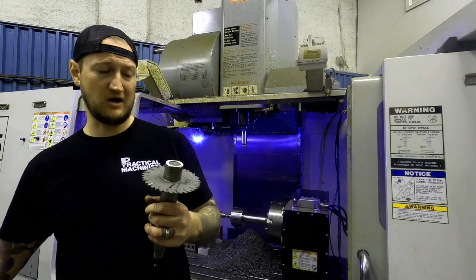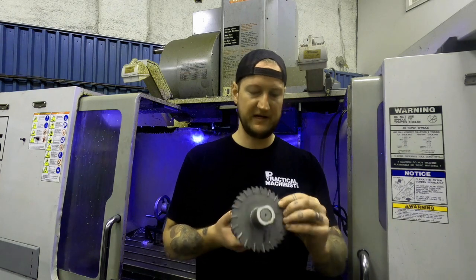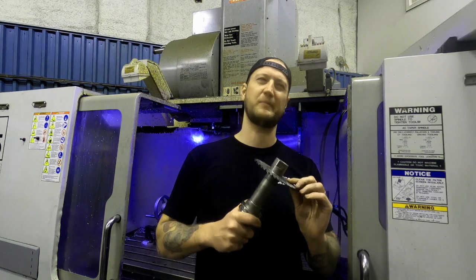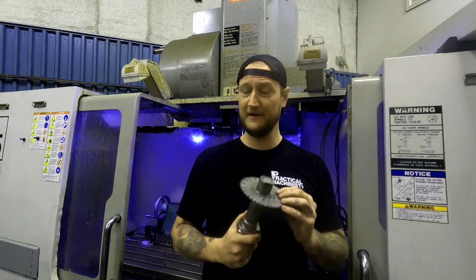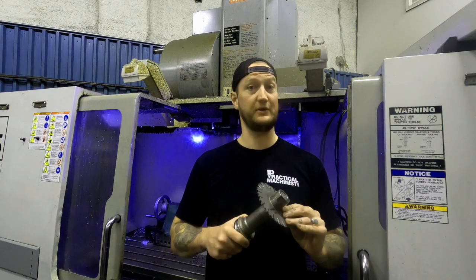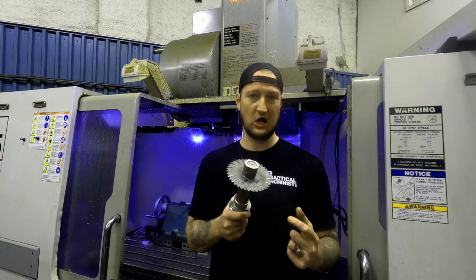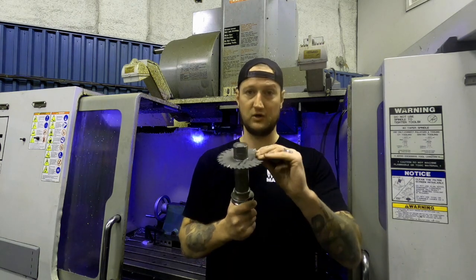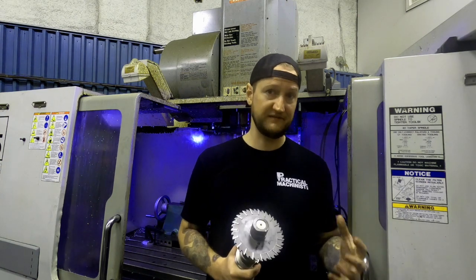Now this is just an off-the-shelf slitting saw. It's carbide tipped, which is nice, but the body is just high-speed steel. We're almost at the point where we're doing this job enough with insertable carbide. Some tooling manufacturers make really, really cool ones. Everywhere here where you see a tooth, there's actually a carbide insert. They're very, very handy because they do have very good rigidity. And once you get the speed and feed dialed in, the performance of it is very, very good.